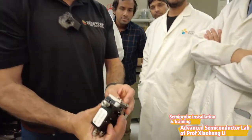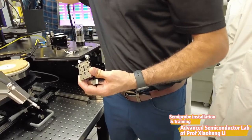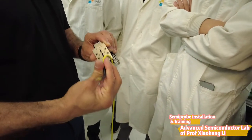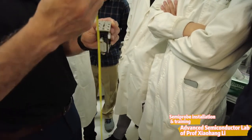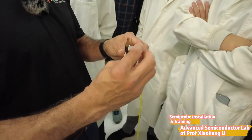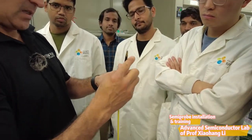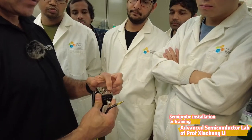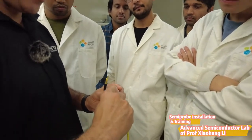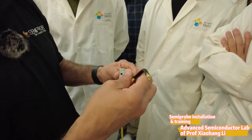You have multiple ways of putting the arm. When you have an arm like this, it plugs right into the hole, and you tighten it using the set screw. If you want coax instead of triax, it's the same interface. You can put the arm here, here, or here — depending on the height of your device. There's a nice design detail: it's not a complete circle, which would rotate. There's a little notch that gives you one edge, two edges, and the set screw is a third edge, so it prevents rotation when you tighten it.